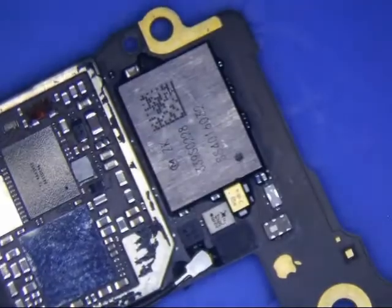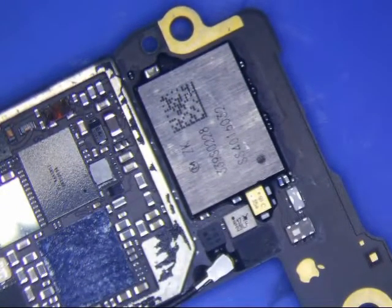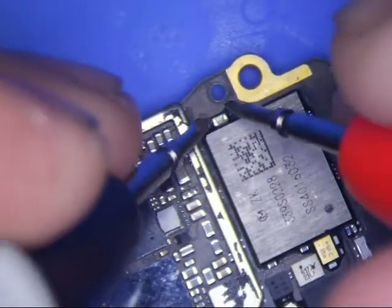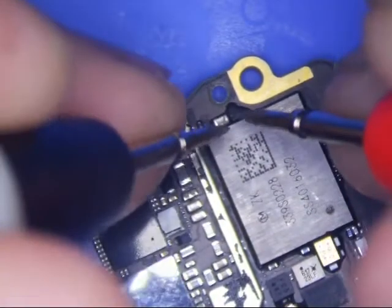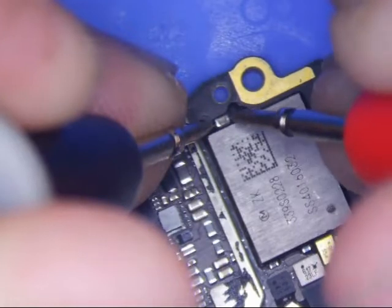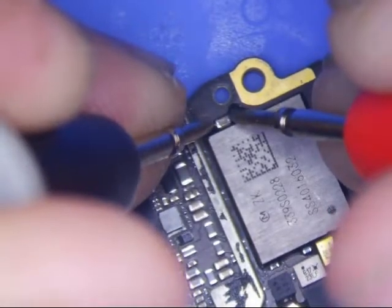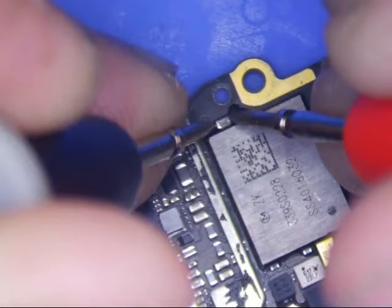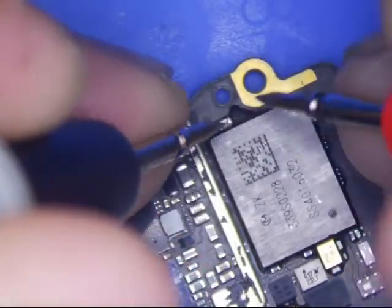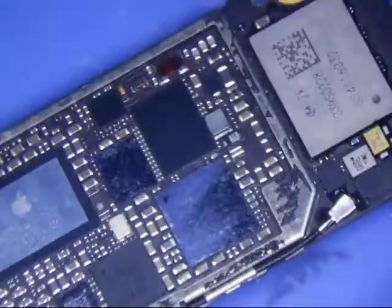Alright, let's see. Looks like it might have been water damage. The first thing I always do is test C5202RF — always. It's not beeping but it has low resistance to ground, so there may be a fault there somewhere. It's showing 154 ohms, which should be a little higher — or infinity, I believe.